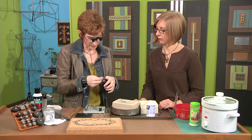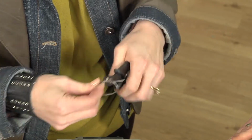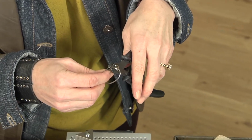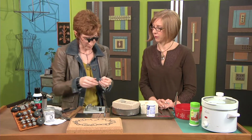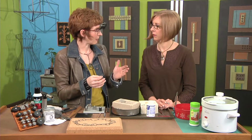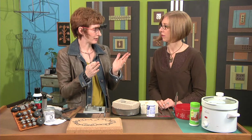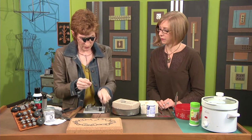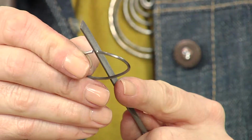I'm going to use my cutters. A nice heavy-duty cutter, because we are working with 16 gauge wire. These memory wire cutters are strong enough for steel, and they're a double flush cutter, so that helps us in the long run. One of the things about soldering is that we want that joint to be perfectly parallel. Solder doesn't want to fill gaps; it wants to marry things. So we have to use an equaling file, which is equal and parallel on both sides. So that helps us again.